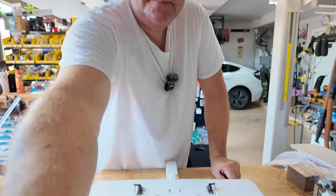Sorry for the interruption. Let's get back and start building the airframe. Avionics up there. So we've got our fuselage mounted. We've got our motor doubler installed. At this point, let's go ahead and put the motor with the mount. And we'll install this. I'm going to pull this piece of hot glue that's caught in there. That's going to want a little drop of alcohol. Hang on.